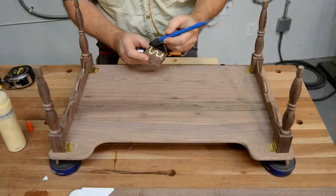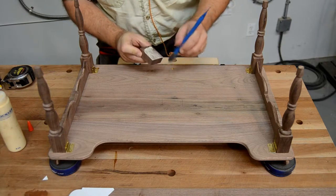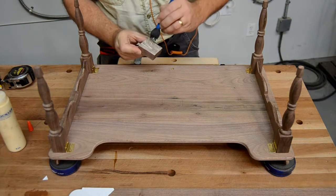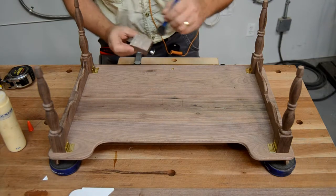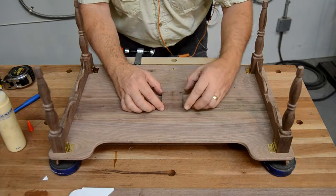The spring block is simply glued onto the bottom of the tray in the area we just marked out. It's held in place with just the glue — I didn't want screws showing on the top part of the tray. Be careful about the amount of squeeze-out you'll have to clean up later.